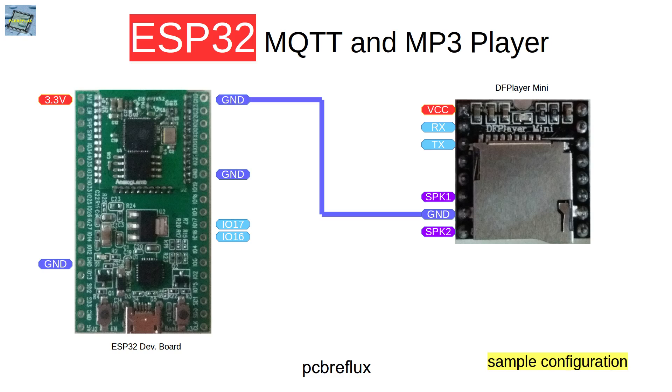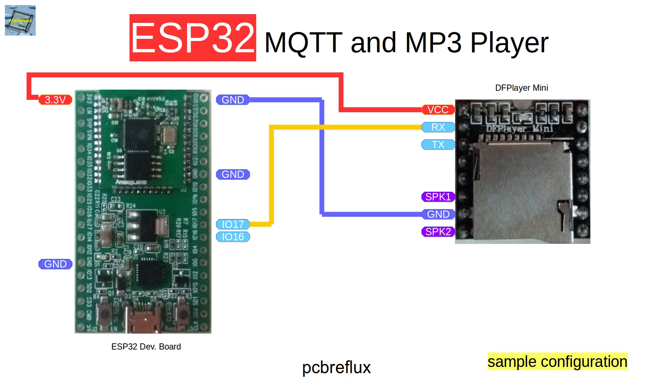This is my wiring for today. I connect the ground wire to the MP3 player, then the 3.3V VCC line, and I use the second serial interface from the ESP32 and connect to GPIO pins 16 and 17. I connect the serial transfer line to the RX input of the DF Player Mini and the RX pin on GPIO 16 to the transmit output of the DF Player Mini. I find out that I also need a 100k pull-down resistor to have a stable connection to the DF Player Mini with the ESP32.